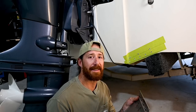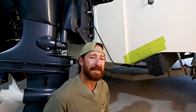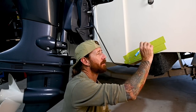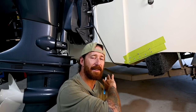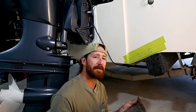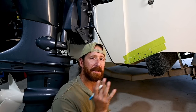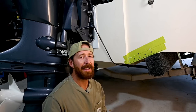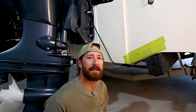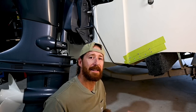While we're on the topic of marine sealants, everyone knows how messy these can get. Another little trick — also why I put the tape on: just trace around the outline of your base plate or your trim tab, grab a razor blade, cut it out, and then no matter what you do cleaning your Sikaflex or sealant from the trim tab once you've fixed it, you can just pull the tape off and you won't have all that excess mess on your hull that you have to clean off.